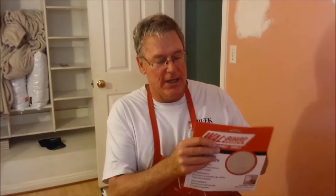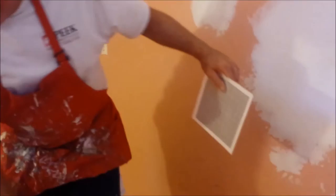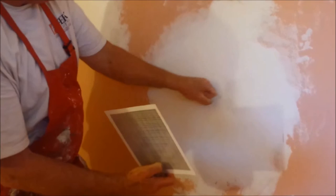One of the things that you need to do as you're painting the inside of a room is check for holes in the wall. Often times people will open a door too quickly and the doorknob will go right through the wall. Wallboard has made these really cool repair kits where it's a metal plate with a grid on it that sticks over the hole. Here's an example of one that I did yesterday — the hole is about the size of my fist. This goes right over the surface and itself sticks.